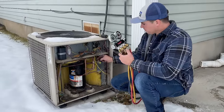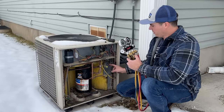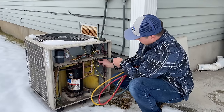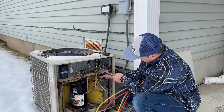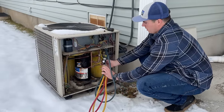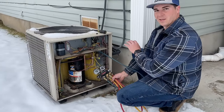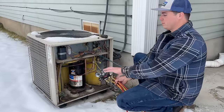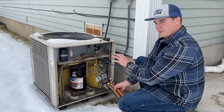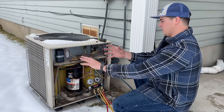That's all we have to connect to do this procedure. I'll preface this by saying: if your condensing unit is not working and the compressor does not work, this method will not work — you'll need to pull the refrigerant into a recovery tank. But if your system is still working and you're just doing an upgrade like we are here, you can definitely use the existing compressor to pump all of the refrigerant into this unit, contain it, and then disconnect it from the house.